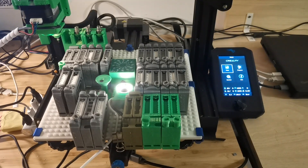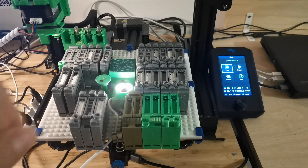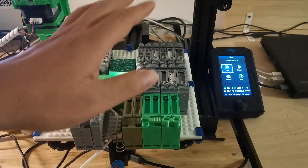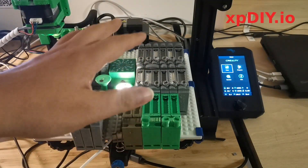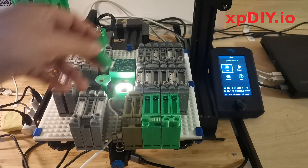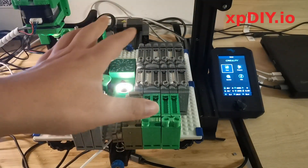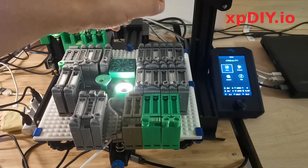Hello everybody, welcome to my channel. I've been working on feeders for the past months and I designed the tremor feeder, which I've been happy with. I've also gotten feedback on how to improve the feeders. When using those feeders, I'm feeding about 30 feeders in a plate, but each time it only exposes about 13 to 14 components to pick, and afterwards you have to advance the tape manually. I don't really want to do this because that means after 13-14 components we need to stop the job and adjust.